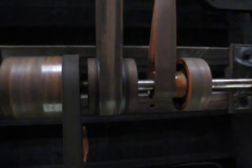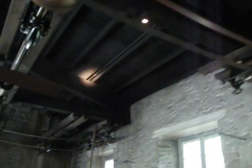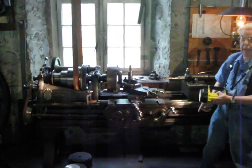We have the line shaft on, and we have belts to each machine, but none of the machines are running quite fast. I'll show you how you turn one on. Look at the belt here from the line shaft — it goes over to the pulley by the window. The pulley that's turning is not connected to the shaft that goes through the middle of it. However, the pulley immediately on the left is connected to the shaft. So this is the on-off switch right here — move the belt over to the other pulley and that turns it on. There are four different diameters of pulley up here and four diameters down here for different speeds. The belt on the small pulley up there to the big pulley down here is slow speed.